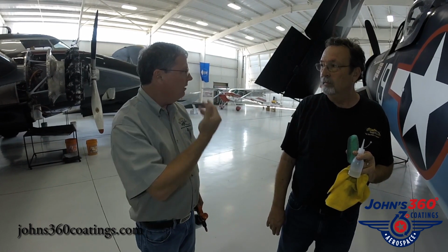Again, I'm most excited about the polished airplane, but it protects anything. It's great for automotive, great for boats, but it's great for an airplane that goes Mach 1 too. This ceramic coating can handle temperatures of many hundreds of degrees. In fact, over 700 or so, it actually turns into a glass, a true hard ceramic coating. So exhaust fumes are not going to hurt it; if anything, they'll help it a little bit. We get all kinds of oil and grease coming out of these exhausts and down this fuselage, and it's going to help us protect this airplane.